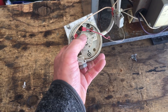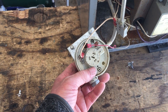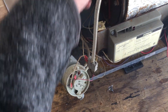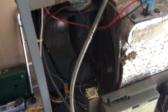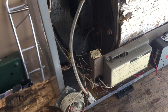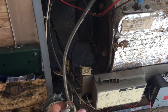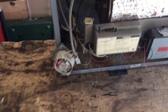There's a little adjustment you have to make on these switches — I can't remember exactly how to adjust it, I'd have to get back to you on that — but there is an adjustment so it'll work with the T-series. This one on the air intake almost never has to be replaced. The only time that would come into play is if you had a blocked air intake creating enough negative pressure to trip the switch. I don't think I've ever seen that happen, so most of the time you don't have to worry about that switch. It's just the one hooked to the blower — there's a tube that goes up to the blower — those are usually the ones that fail.